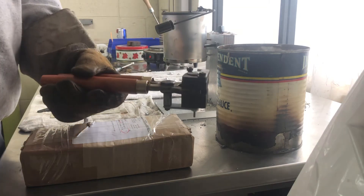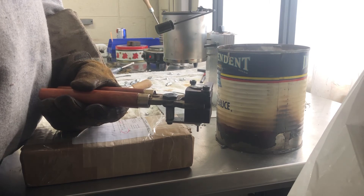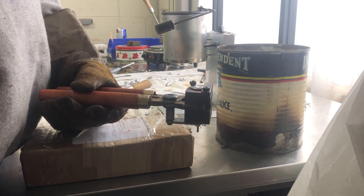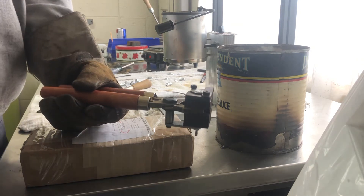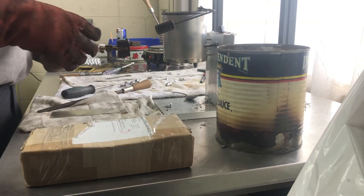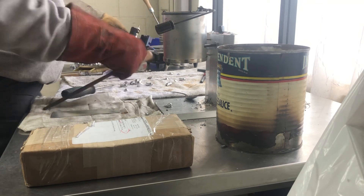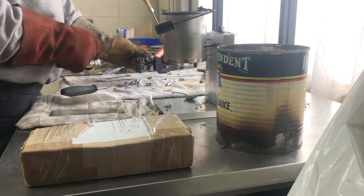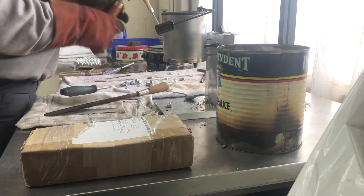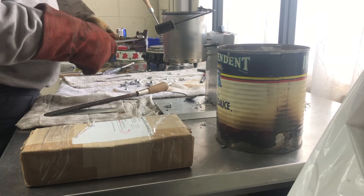That sprue cutter — I've got to go with a little bit deeper angle than 45 degrees. I used a 90-degree bit to cut the sprue and it left a little bit of a straight shoulder on that. So I'm going to go with an 82-degree countersink on the next one I cut, and the sprues should fall right off.